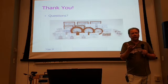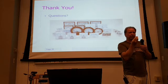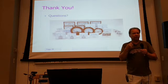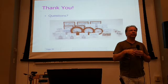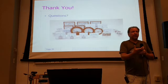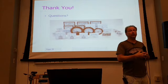With these cheap meters, if you open them up, a lot of times the contacts where the probe goes are just bent pieces of metal soldered onto the circuit board with no kind of strain relief. You use the meter 100 times, it's fine, but eventually you stress and fail those joints, and then they'll arc and become intermittent. So the design fundamentally works, but whether you use it 100 times or 1,000 times or 10,000 times, how's it going to hold up?